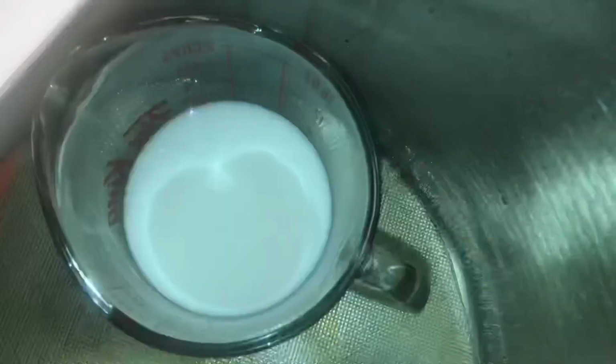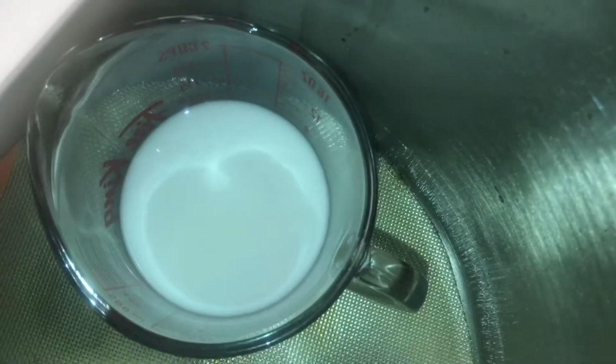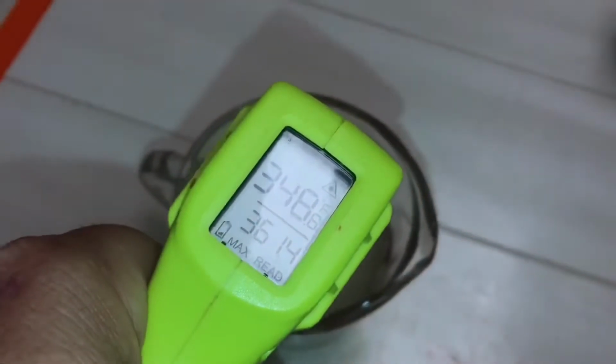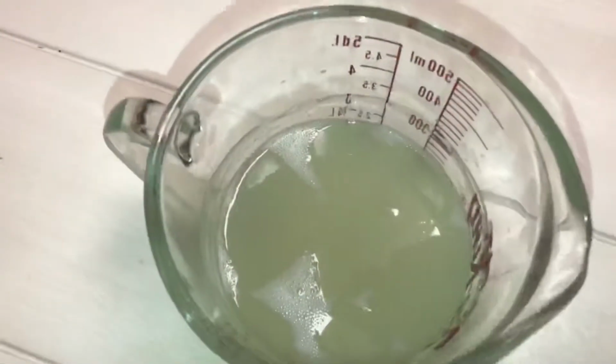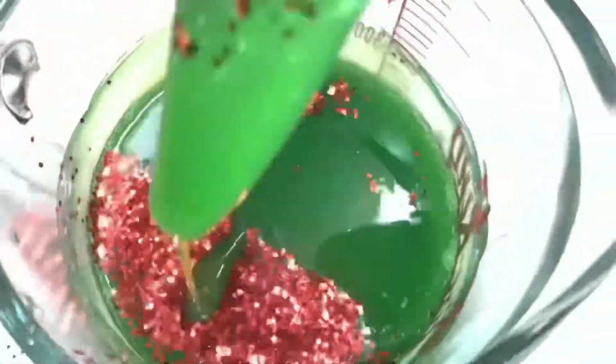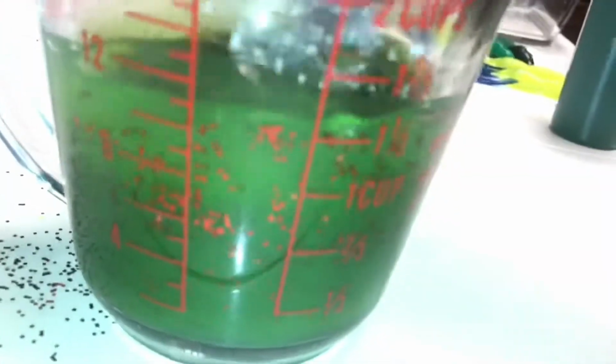And even though we don't necessarily need to do this with Dead-On plastics because it pretty much arrives from the factory free of any excess moisture or air, it's a good idea to be sure. So from there, we're going to go ahead and cook it up to about 360 degrees, and then we can go ahead and start to add our pigments. Once we've got the color where we want it, we add some of our high heat resistant flake, and just like that, we've got one of the most popular colors in the fishing world, watermelon red flake.